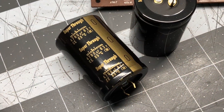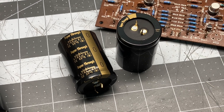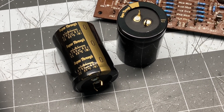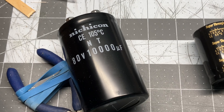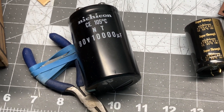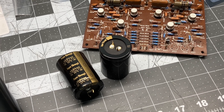The caps we're going to use are Nichicon super through caps — 4700 microfarads at 63 volts. It was recommended to me to use a good high-quality audio-grade cap because these caps are directly in the signal path. This is our main filtering cap — I believe it's the Nichicon LNT series — and this cap has got screw terminals, it's just a really nice, high-end, heavy-duty cap. That's what we're going to be using. Anyway, I'm going to go ahead and end this video and I'll see y'all next week.